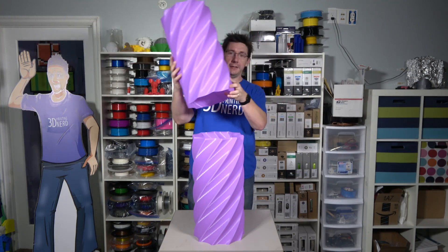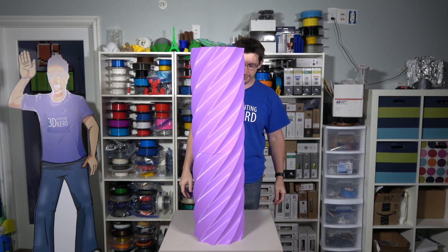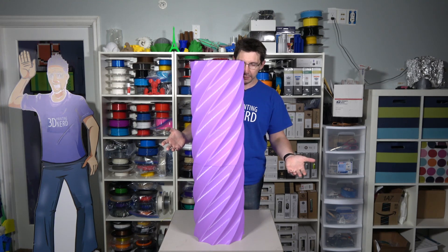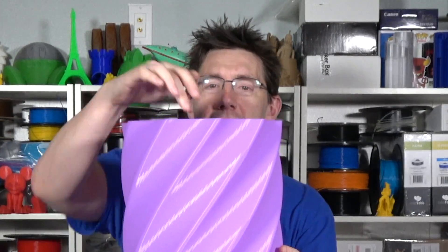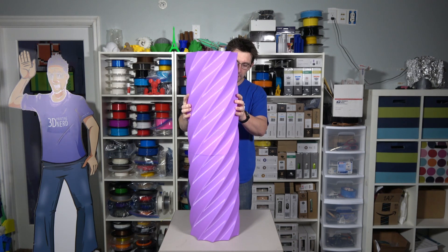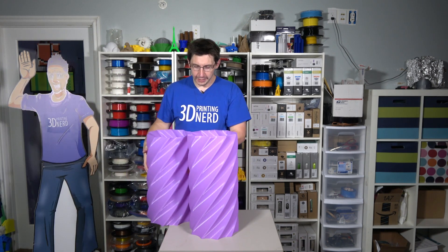I scaled them up. It's kind of working, but it's going awfully slow. If I look at the top when I try to pick it up, I can see the bottom layer of this one actually being sucked in as it's trying to battle the suction created. So it looks like this is like the second twisty vase connection I showed, where the tolerance between the two pieces is a little too small.